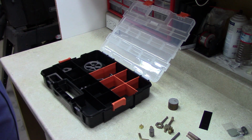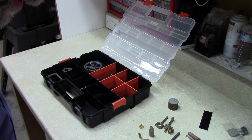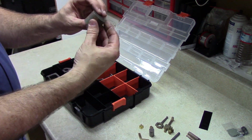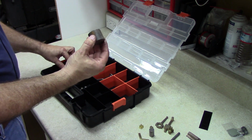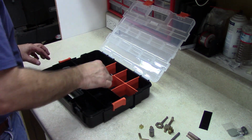looks to be the biggest single piece. And the cylinder covers are cast iron, but what they're noting is it's a 35 millimeter diameter by 1 1/8 inch long piece. So that's this piece of cast iron that they provided. They're not actual individual castings. We're going to be making those out of a cast iron rod, or a piece of cast iron bar. That'll fit there.